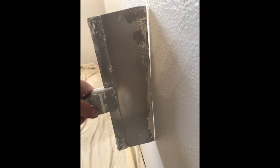Now this one's got several issues with it actually. The big one is it's too thick. But even if they left it that thick, if you were to float that out about three feet wide and make it a nice gentle hump, that wouldn't show. You're seeing it because of the sharp drop-off creating those shadows around the edges. So you want to figure out how wide you need to coat it to make it go away — that's kind of an experience thing, so I recommend just floating it extra wide. You can't really hurt yourself by going too wide, but you can hurt yourself by going too narrow. Put a straight edge on it like I did here — I just used my 12-inch knife and see how much it rocks. In this case I went ahead and coated this about 24 inches, and on some really bad ones I've even gone four feet wide. You just have to go wide enough to make the hump softer and more gentle.